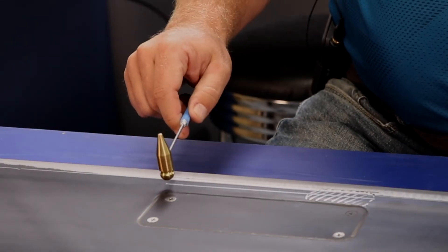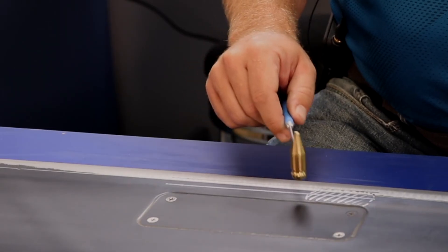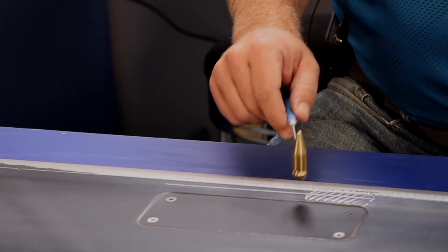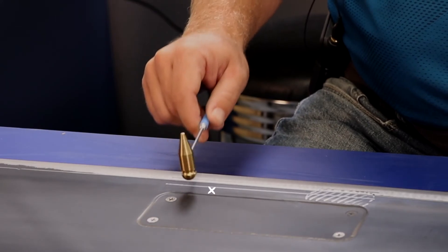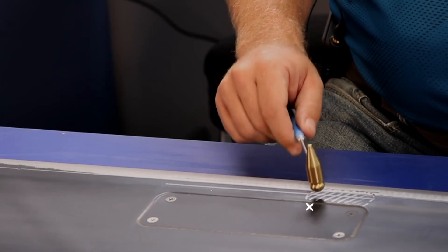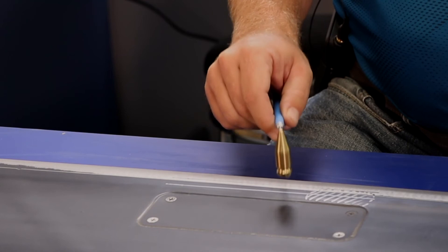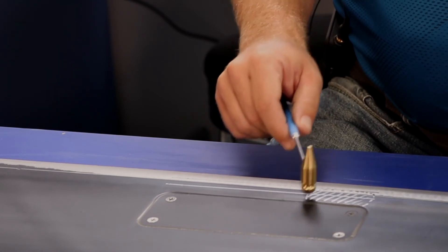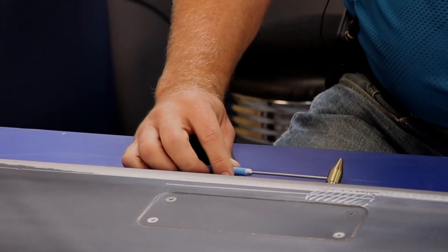I'm going to start here at the outboard end. You'll hear a nice solid tone as I work my way inboard, and then listen for the tone change right as I cross the crosshatched area here. You'll hear a more flattened, deadened tone — kind of a buzzing sound. It should be pretty clear. So you hear right in that area it goes from a solid sound to a buzzing sound. That's all we're trying to do — determine right where that starts. And right there is about the length of your delamination.